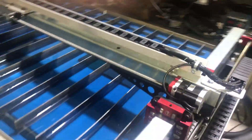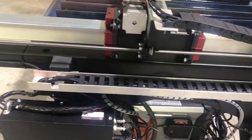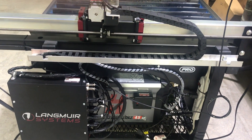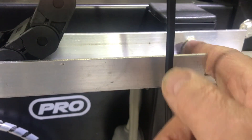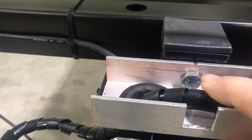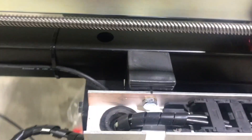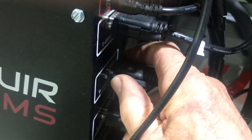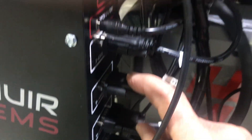On the Y axis, it's the same piece of channel but cut smaller — down to about 32 inches — just enough to span the two legs of the table. I notched it out to provide access to the existing bolt in those two legs and attached the channel to them. The only other thing I did was make a hole big enough for a large grommet, and that hole has to be big enough to pass two of the drag chain ends through it.